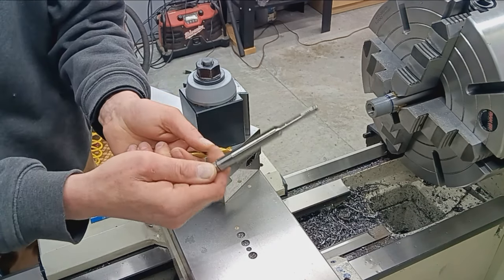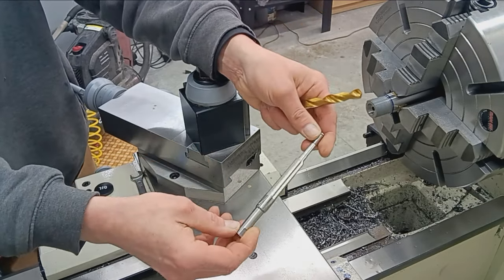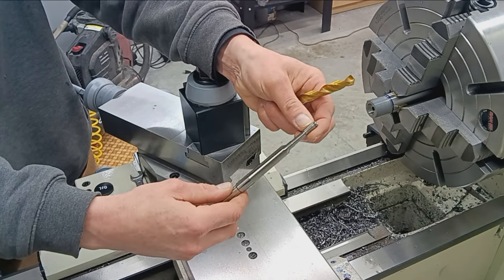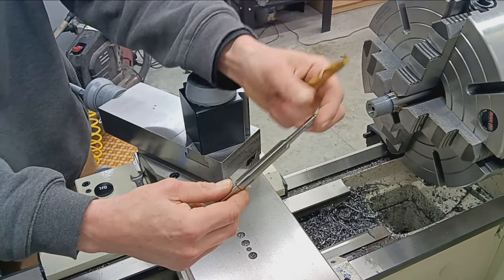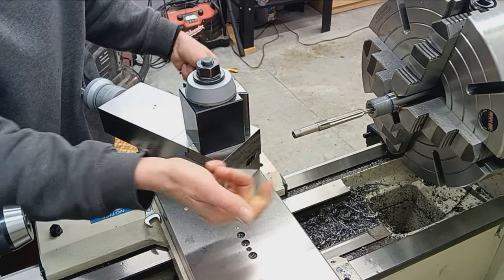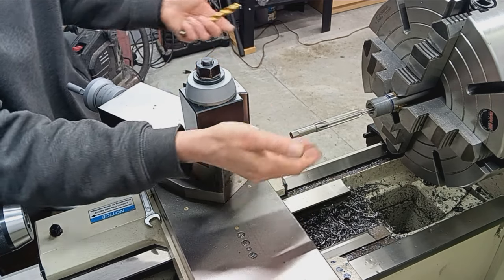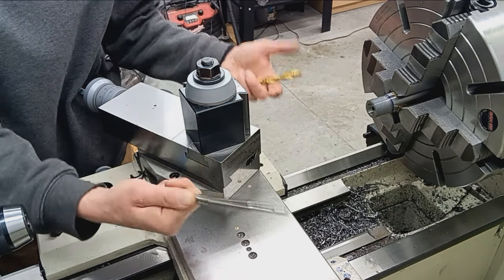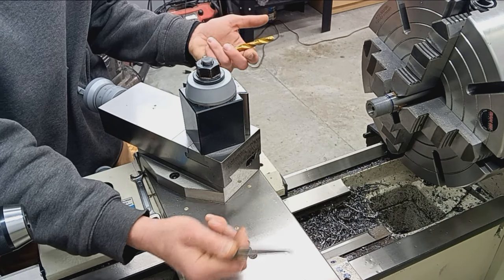Here's our chambering reamer. 6.5-284 finishing chambering reamer. Live pilot. I will switch out that live pilot to the bushing that fits the bore perfectly. The idea here, you can certainly cut a chamber from beginning to end with a finishing reamer if you really wanted to. However, to avoid premature wear and tear and to save probably an hour of time,